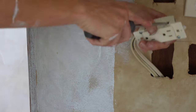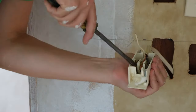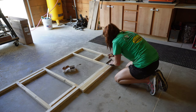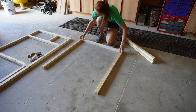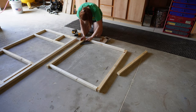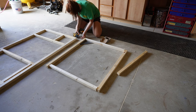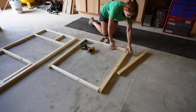Because I don't have a whole lot of slack in this outlet, I'm actually going to take the wires out. Normally I just clip them, but I want the extra space just in case. There are little tabs on the side — you press with a screwdriver and then pry the wires out. Obviously make sure your power is off first. Next I'm going to start on the back piece that's going to support everything from the backside. I'm basically making a template of what I made on the left side, but I don't need the bottom half because I'm not supporting the fireplace or the electrical from the back — I really only need the TV support and the little cubby from the back side.